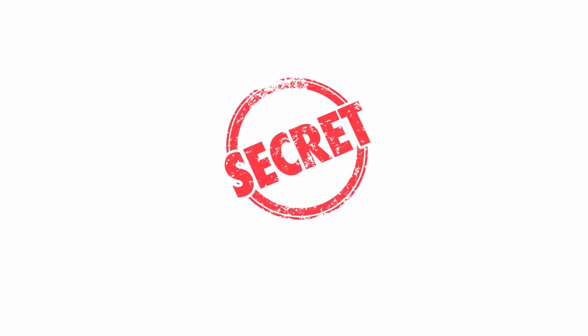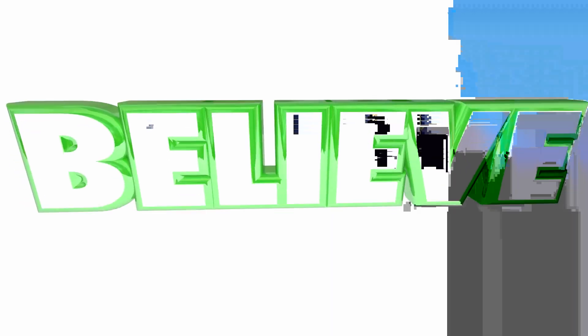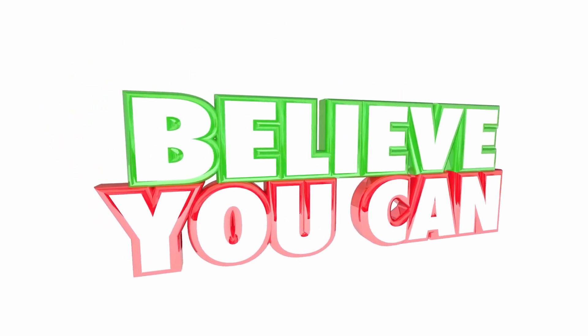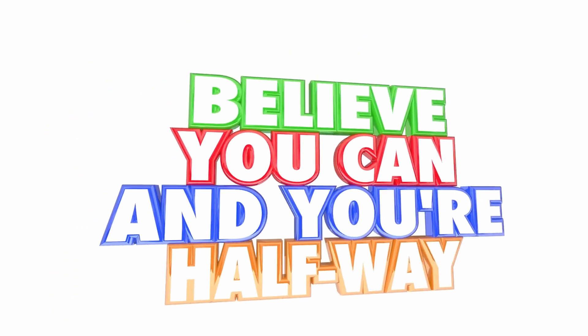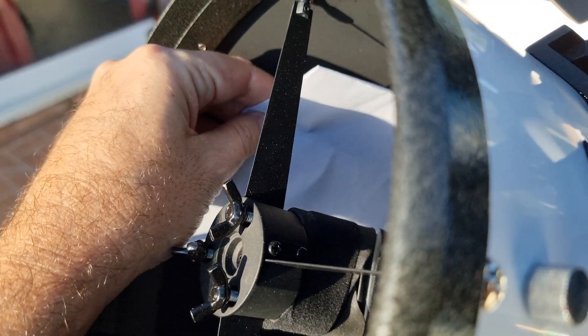Here's another tip: make sure you work this part with the tube horizontally positioned. That way you avoid major problems until in the future you have the confidence to work at the top. Now, let's insert a piece of white paper behind the secondary mirror, and then look through the cap or the concentric. The goal is to get the secondary mirror centered to the focuser, and here the concentric tool shines bright, because with those concentric circles, it turns your job much easier.